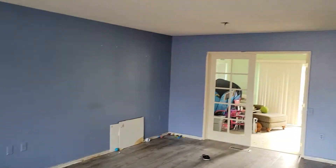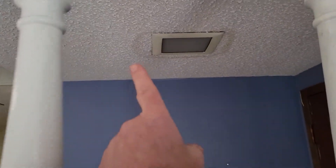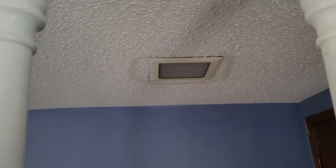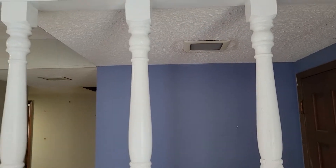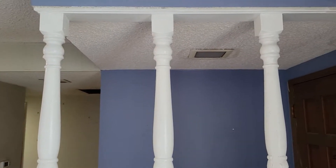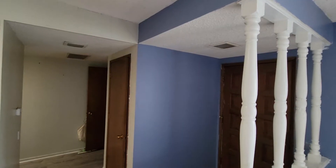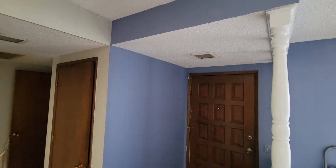There's also a bunch of light fixtures you need to do. Dining room. There's a few of these that have a square can light that need to be replaced, so there's going to have to be some sheetrock patch there. You're going to get a new LED fixture that'll just get tossed up there. You'll have to patch around there to fill it in. They don't make a trim kit for that very easily to purchase, so you're going to replace these square can lights.